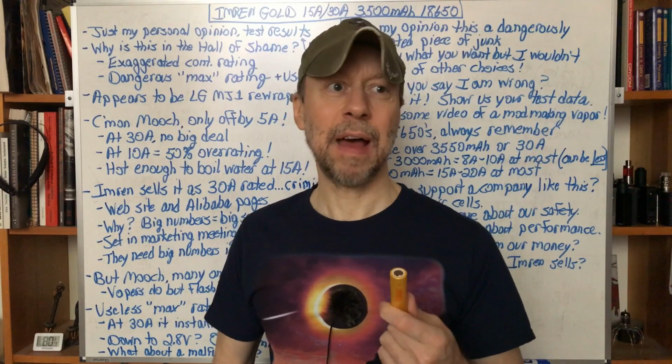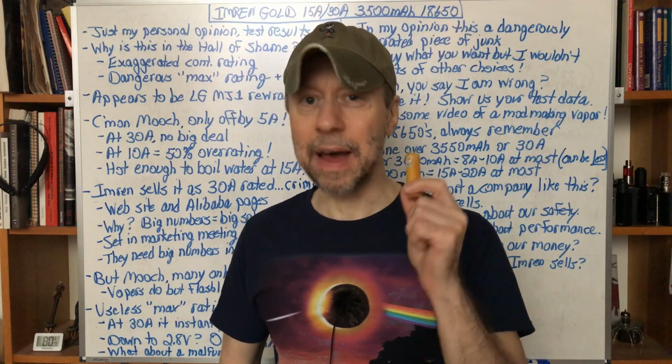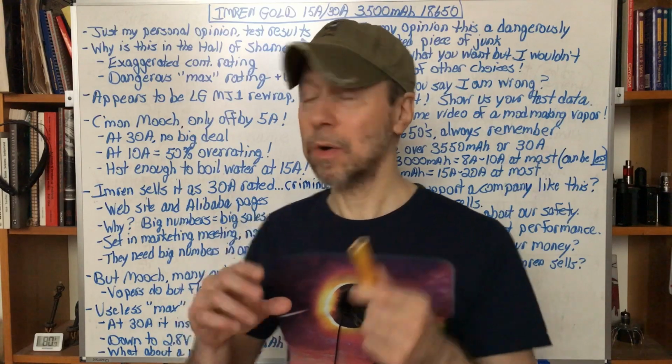So you go, oh, only 5 amps more. Yeah, well, that means a lot when you only have a 10 amp ultra high capacity battery with lots of internal resistance. They're just not made to be used hard. They're made to be used long at low current levels.